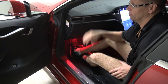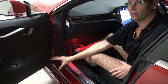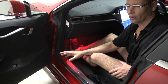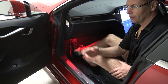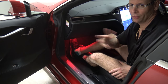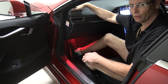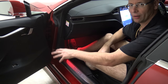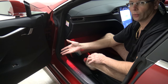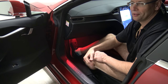One thing I discovered during setup is that the front door speakers have a low-pass filter from the factory amp — so there was no treble going to these. Their logic was apparently to feed all the treble up at the dashboard and just bass to the doors. I wanted to reduce some of the bass on those, and that's how I discovered it — when I took the bass out there was nothing left, because the treble was already gone. What I can do with the amp is make that channel a proportion of the dashboard feed, which was full range. Now I can set a high-pass filter on the door channel to get rid of some of that bass so it's not struggling — and with the subs doing the bass, taking it off the doors just gives them more power and gets them louder.